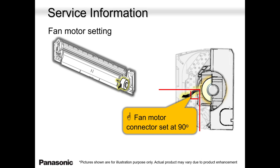One or two compressors will come in here, seize. And we find out the pipeline was over 40 feet and the guy forgot to add refrigerant. Or at some point along the way, there was a trap. So please avoid traps. And please make sure you add refrigerant depending on the model you're working on. Most, if not all, of our single zones, 24.6. The unit is charged for 24.6 feet.